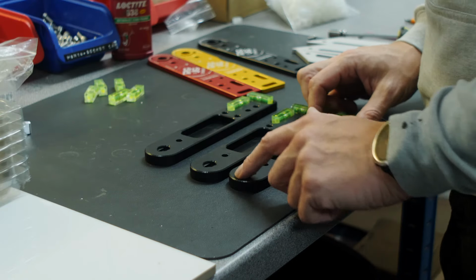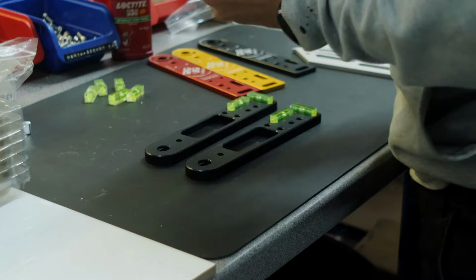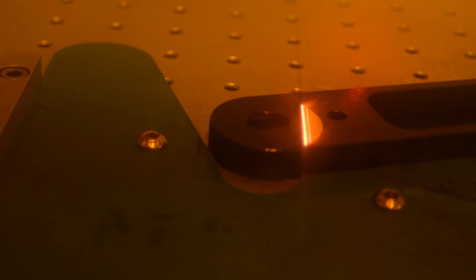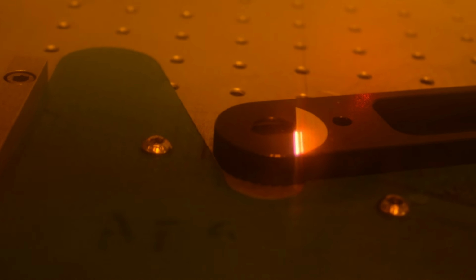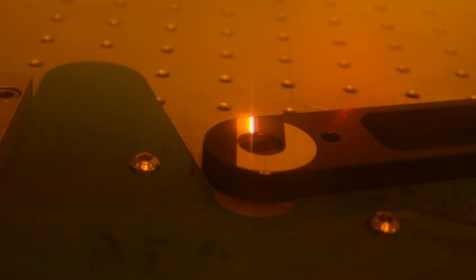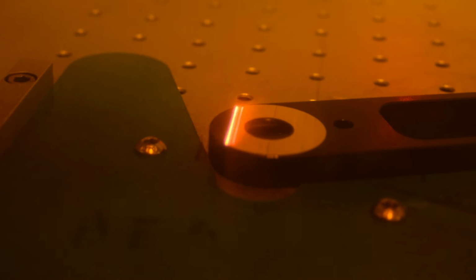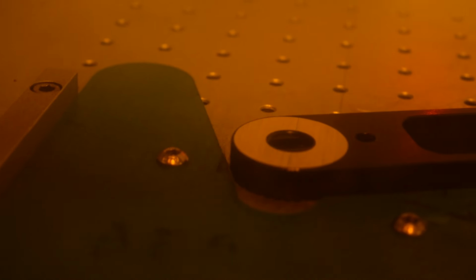But we will be lasering the discs onto these, so these are just some that I'll quickly make up to demonstrate. We discovered that by lasering away the anodizing on the back of the upper and lower, we created a sort of grip disc that would now allow us to anodize the tongs. However, it does mean the price goes up slightly because of anodizing the tong.